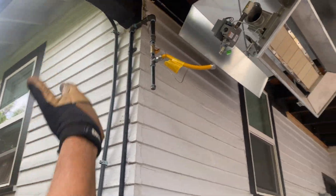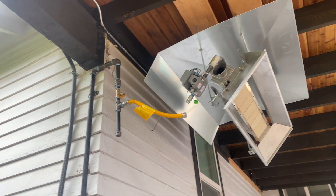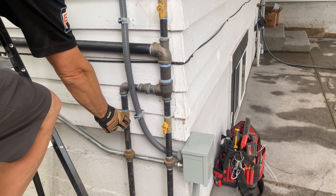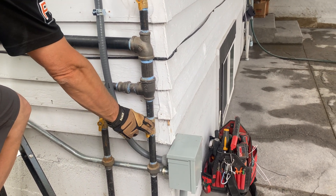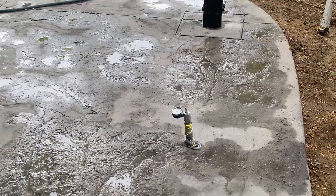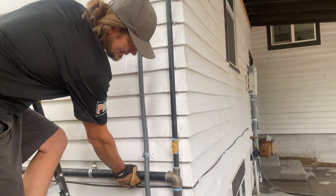If you're doing these gas heaters, you have to have a heat shield — they're going to stain that wood, but it's a monstrosity. All your gas shutoffs for this go out to your fire pit. They're going to have metal cabinets here with a grill, and this shutoff goes to your gas right here. They had to run what looks like an inch-and-a-quarter line back.